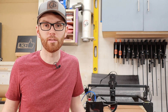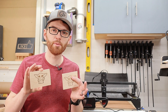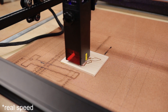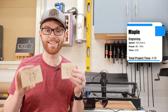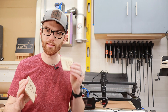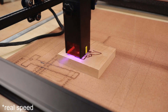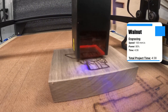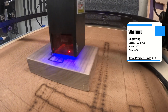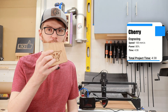However, if you have a metal coated with paint, powder coat, or even anodized aluminum — preferably darker colors — then it can generally make that happen. These first two samples are engraved into hard maple and each took about five minutes to complete. Both were engraved at the same speed, but the lighter one is at 80% power while the darker one is at 90% power. Moving to darker woods, I used the same settings on cherry and then walnut — darker materials engrave better because they soak up more light energy. I really like engraving cherry because it seems to have the best contrast.